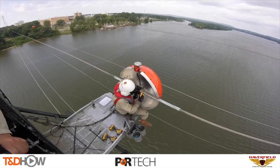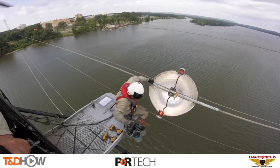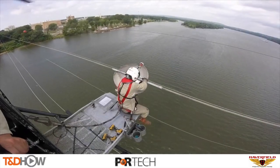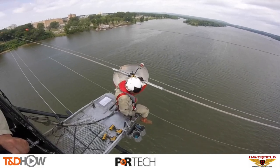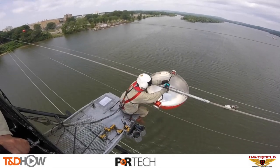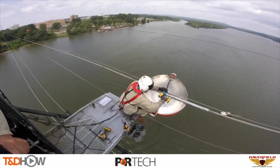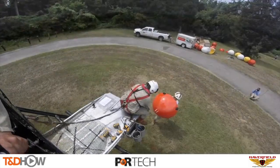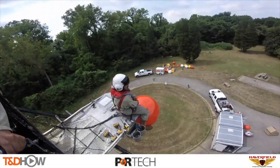In this case, the aerial lineman simply attaches the bottom half of the SpanLight using a couple of temporary clamps, then attaches U-bolts to each side of the bottom half, essentially hanging it on the conductor. The square blue device placed in the middle is called a flux capacitor — it draws power off of the line to illuminate the two red LED obstruction lights. Any line carrying between 40 and 2,000 amps can illuminate a SpanLight for about 15 to 25 years.